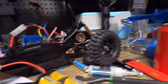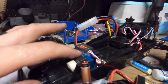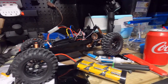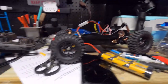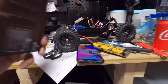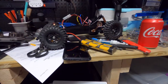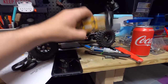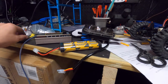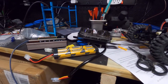I needed to glue the gyro to the top of the servo on the grasshopper so we can get that going — it runs fine, no issues. We need to hook up the new battery charger and charge the batteries, but before we do that we need to make sure they are completely dead. These are nickel-metal batteries, and nickel-metal batteries will build up memory, and you don't want memory on your battery.